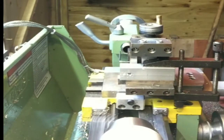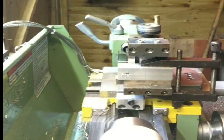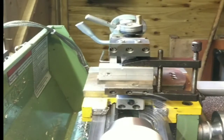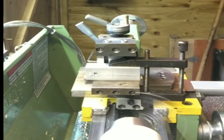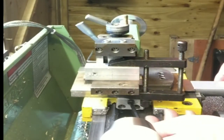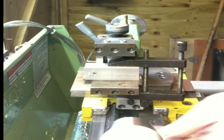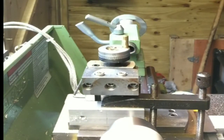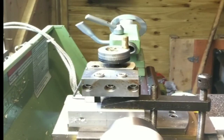This one spotted. Loosen the clamp. 22.5 the other way. There we go. 21, 22, 22.5. Spot the second hole. Well, that will make them 45 between centres. And I can drill them out after with a 5.1 drill.